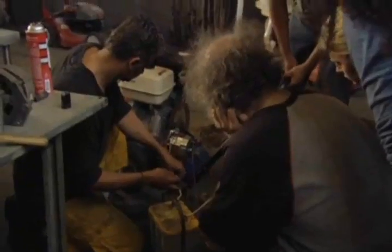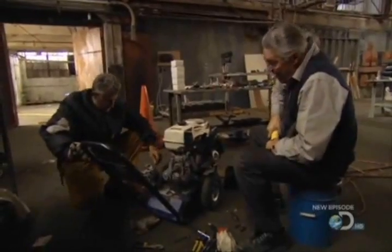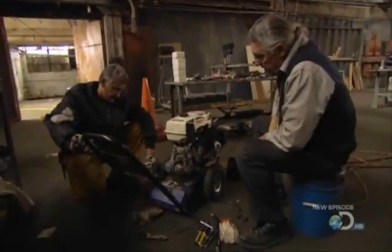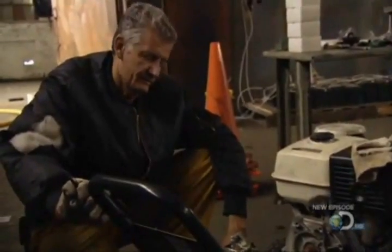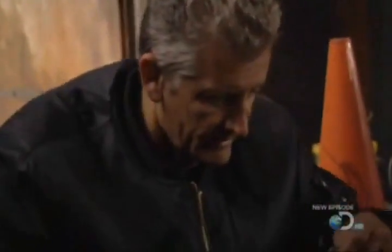Okay. Well, we got up to about 9 volts. If we don't get to 12 volts, we're not getting anywhere. Oh, there's a problem. This pulley is lower geared than the alternator. So we're running a 3/4 to 1. It's not gonna cut it. The pulley is too big to spin the alternator fast enough to produce 12 volts and recharge the batteries. We have no choice. We have to find a smaller pulley.